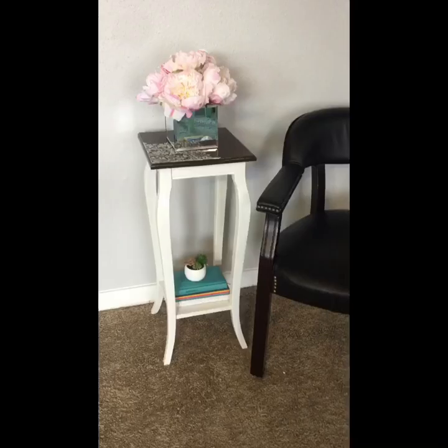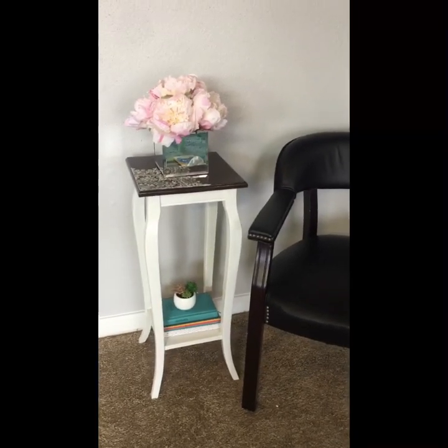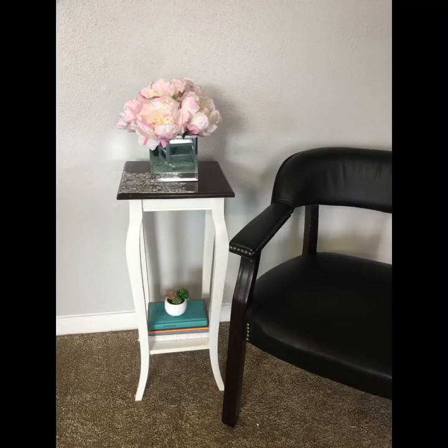Because my stencil is not perfect, I decided to distress it slightly at the edges with the 220 grit sandpaper I previously used, and then sealed it off with two coats of polycrylic, just as I did on the top. The top took three coats and the sides two coats. This is what it looks like, and I'm very happy with the way it turned out — I hope you like it too, thank you for watching!